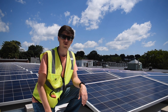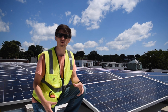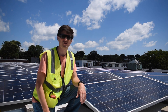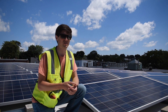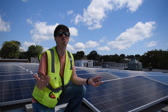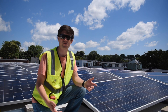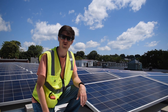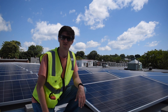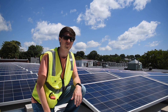What makes for bright, good, strong sunlight is called irradiance. It's usually measured in watts per meter squared or BTUs per square foot, but mostly in the solar industry we say watts per meter squared. By IEC standards, you want to have over 600 watts per meter squared before or during your drone inspection. If you're in New England and it's wintertime, sometimes it's hard to get 600 watts per meter squared — you can dip to around 500 — but by IEC standards, we want to be above 600 watts per meter squared.